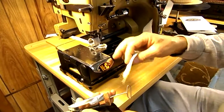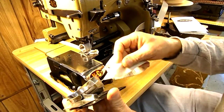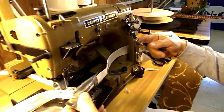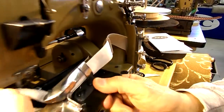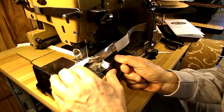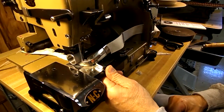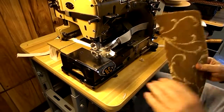The way it gets put on: you make an arrow on the serging tape — the inch and a quarter serging tape — put it in the folder, get it started, pull it out. The tape itself goes behind this guide, not through the tension bracket — behind the guide. Then you slip your attachment on like you would any other TPB quick mount attachment, and push it all the way to the back.